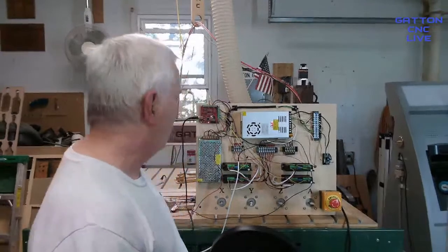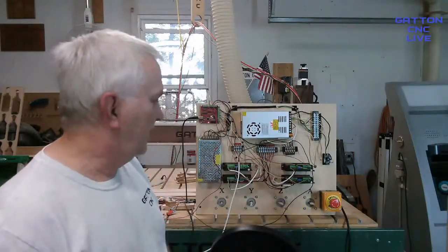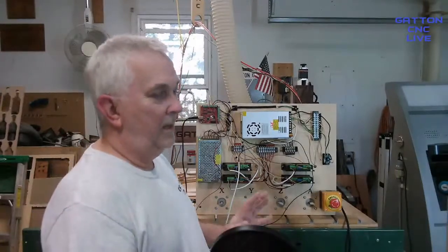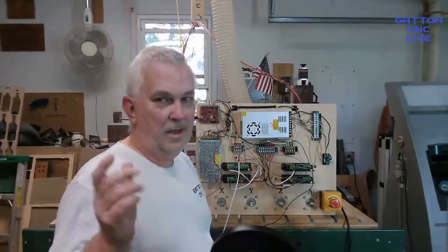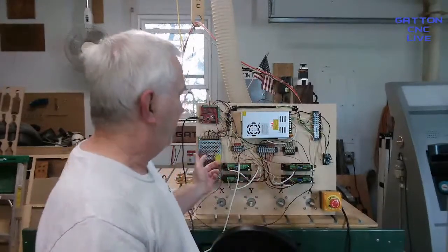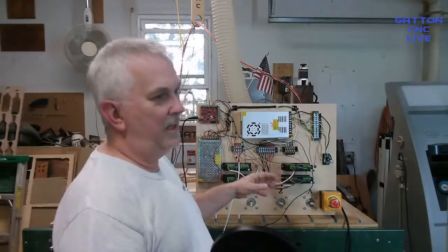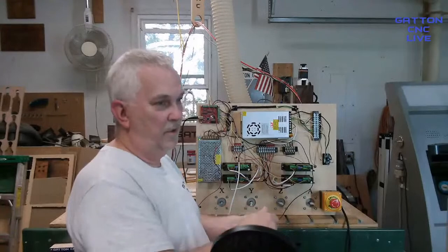But anyway, like I said, folks, that's kind of a basic thing. And again, it's messy now that I've put all those wires in front of there. But I would suggest if you're a newbie and you're doing this DIY, I wouldn't worry about the e-stop, the touch plate, the limit switches, and the homing switches. I'm not saying don't put them on your machine, but I'm saying get it to this point where you can move the machine around, because when you don't have any limit switches on, you hit reference all home and that sets 0 wherever you move it to. So I ran my old Sidewinder like that for years, and I would encourage folks to, before they get to trying to do all this extra stuff, if they get it to this point, enjoy your machine, play around with it, make some chips, and then come back and go, okay, I'd really like to have a touch plate, because I want to do some text on text. And it's really important that you get an accurate Z instead of doing the paper thing.